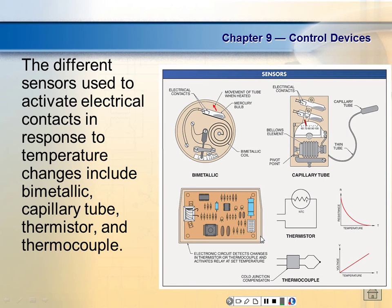Now the thermistor — this is the symbol for the thermistor; it has a circle with a T inside. The problem with most semiconductors is that they're nonlinear. Linear means it varies in a straight line. Looking at this chart — temperature on one axis and resistance on the other — you can see it's not a straight line. So the thermistor is nonlinear, meaning it does not vary its resistance proportionally to the temperature.